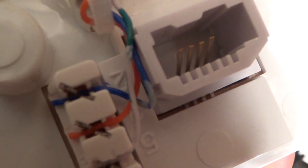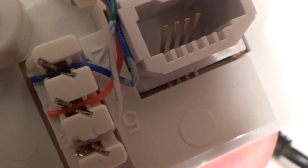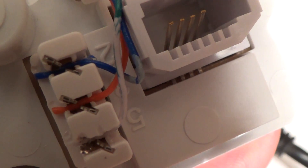If you look at number two and number three in the middle there, you can see the diagonal IDC is done correctly and the wires are pushed in. But if you have a look at this bottom one — can you see that? When it was punched in, because this cupboard is normally quite dark and there's a lead light up here at the moment, the wires were punched in at a little bit of an angle. As you can see it's only just barely made contact because the other bit of the IDC has come apart.